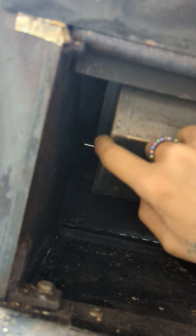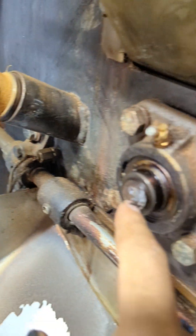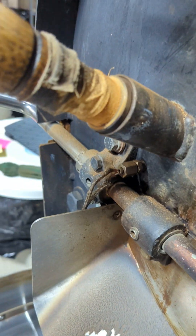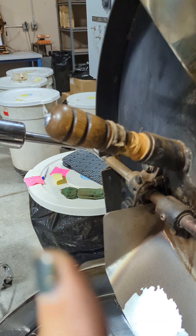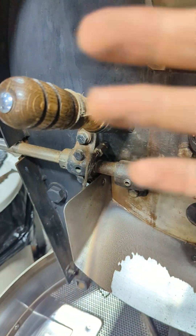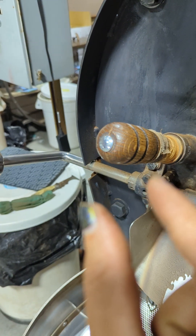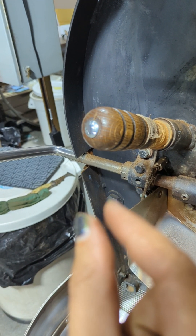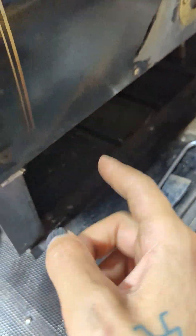That gap doesn't stay consistent. Normally what you would do is, before you tighten it all with the set screw, you'd kind of hammer it out so that it's an even gap — because you don't want it to actually touch and rub, but you don't want it wide enough that any coffee beans can get through, which is why chaff can sometimes accumulate down there. I have to vacuum it out like maybe every three roasts otherwise it accumulates too much and risks setting fire. But that might be specific to us because that drum is warped — so to get the smaller end of the gap you also get a bigger end, and it makes a lot of chaff go through and even some unroasted beans will get through.